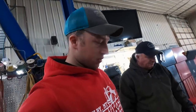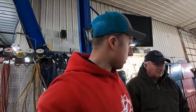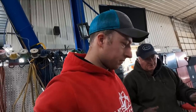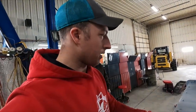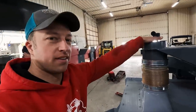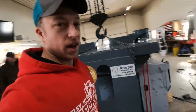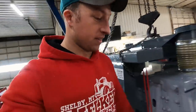So the next question is, how do we get the straw to stop going through it? Well, we really don't have straw with the peas. No. It just didn't fall through the screens at all. You need wind. That's the one thing this doesn't have, which we're going to try to adapt, though I don't think this will be enough. There is a way to mount an air system on here that'll suck out of this tube, out of the end, and over here. But it's quite an extensive system, so we're going to see if we can do it for a little less complicated and a little less money.